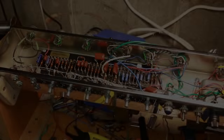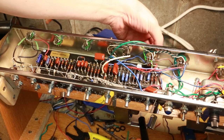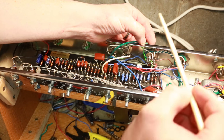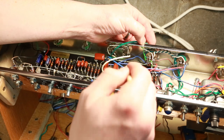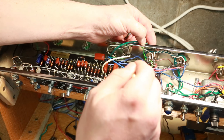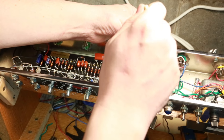Today's been a busy day — got a lot done, not quite finished but worked on it pretty heavily. I've got all of my power tubes wired in. The blue wires are the outputs — one output comes from here, the other from there, and each hooks into a tube. The power off each of these goes over, and I also got the grounds off those — the black wires coming out — with a one-ohm resistor on either side.